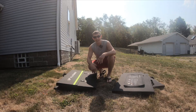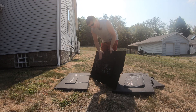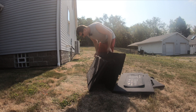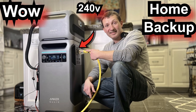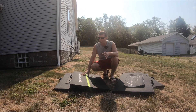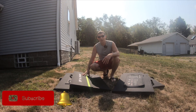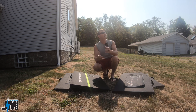Those 600 watt panels are actually lighter than the 400 watt ones, and I'm going to connect them into the other port of the Anker Solix F3800. The 600 watt panels have an open circuit voltage of 52 volts and the 400 watt panels have 45 volts. The unit takes up to 60 volts of input, so we're going to parallel these panels together so we don't go over that limit. It can take up to 25 amps on each input.